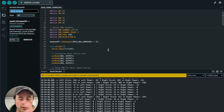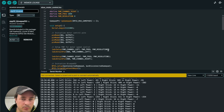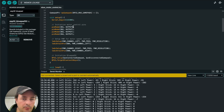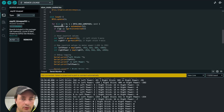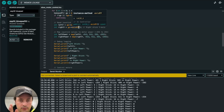I'm not going to go through everything in the code — I'll link it below. Up at the top are all your pins, so set those to the relevant GPIO pins for your board. In the setup function you're just initializing pin modes. The loop is what we're interested in — it runs forever and checks the controller joystick values every iteration. I'm using axis Y and axis RY, which are the two sticks going up and down — just like tank controls with levers, not interested in sideways movement.